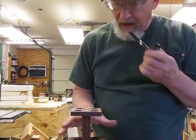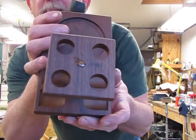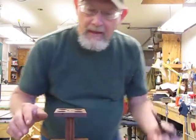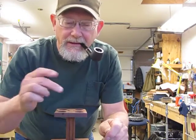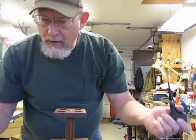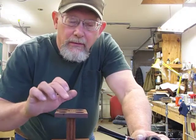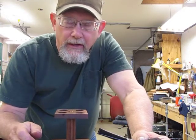I've got some glue on there. You'll be able to see, hopefully, that it's a lighter color, of course. The reason I prefer a lighter color like that is when I get this sanded down in order to blend it in, that'll be a little lighter. Whenever I'm putting grain back in something, it's always easier to make something darker than it is to make something lighter. Since that's going to be a lighter color, it'll be a lot easier to paint the grain into it and blend it in with the surrounding area.